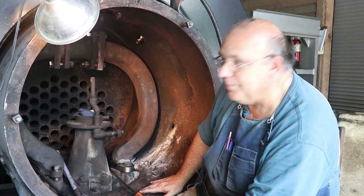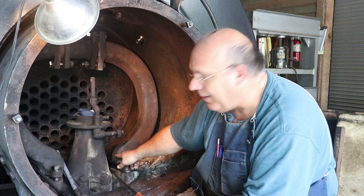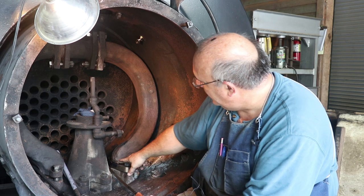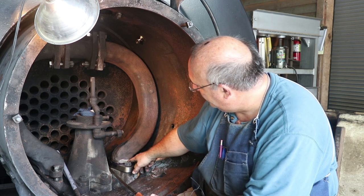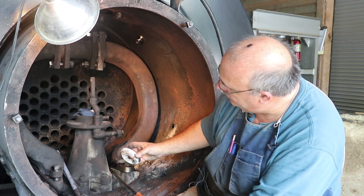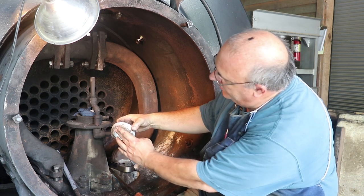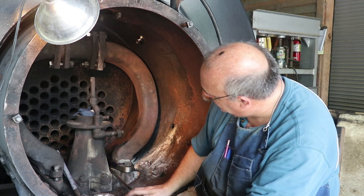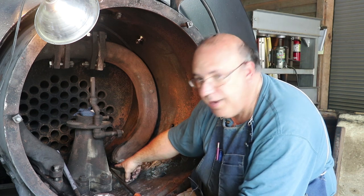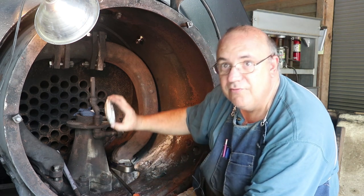So bottom line of where we're at, I've got my measurements on here to get this bottom flat. I know that on the back side I got the exact number. It's roughly 3/8 of an inch gap back there. And so we're gonna have to take some metal off of this side and so forth. Now the steam pipe ring sits up underneath it. The original one comes up about 3/4 of an inch from the bottom. You got a little bit coming down here, but the actual height is about 3/4 of an inch. Like I said, I got 3/8 on the back, so that's going to raise all this up by 3/8. I think what we're going to do is notch this out by 3/8. That'll raise the whole piece up by 3/4 of an inch. It'll be just right for a steam pipe ring.